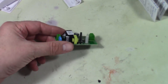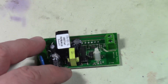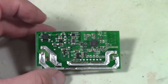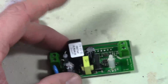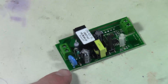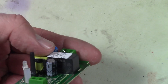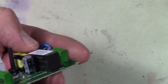Pretty simple circuit here. It looks like it's got just some transformer pulling the voltage down. There's probably a little full bridge rectifier — yeah, there it is, right there on the side. So there's a little full bridge rectifier taking the AC and converting it down to create a little power supply, and it's even got a little MOV on it. There's the relay — that's what's doing all the heavy lifting.